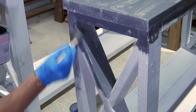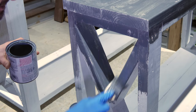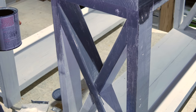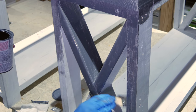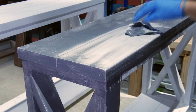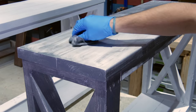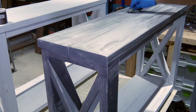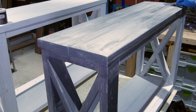The gray stain produces an antique and vintage look that blends well with farmhouse decor. Any color stain works — it just depends on your style preference. For example, I've used light blue and coral stain to distress furniture for a coastal beach look. Next I used a shop rag to wipe the stain. Regardless of how much you wipe, some stain will absorb into the paint, and it's very difficult to remove from seams, corners, and other hard-to-reach places — which is a good thing, because it makes it appear naturally distressed.